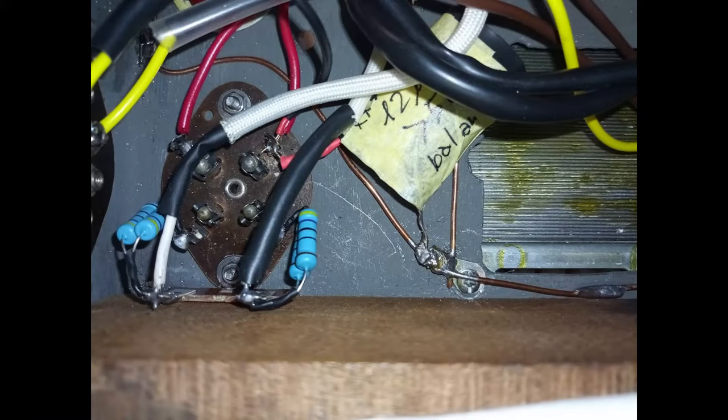There is also an issue regarding the transformer output voltages. The high voltage before the rectifier is slightly higher than what the rectifier tube would allow. To solve the problem, two extra resistors are added to cause a voltage drop before the plates. This solution is not appearing on the final schematics because it depends only on the power transformer specifications and the mains voltage fluctuation. Ordering an output voltage of 340 plus 340 volts would have been wiser.